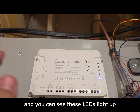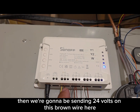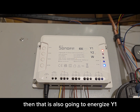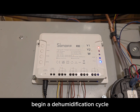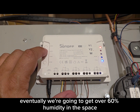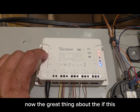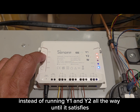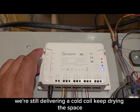Let's take you through a typical cycle and watch these LEDs light up. Say our thermostat is set to 50% relative humidity and it is above 50% in the space — we're going to be sending 24 volts on this brown wire, ready to be used. The IFTTT automation is also going to energize Y1, and regardless of whether we're calling for cooling at the thermostat, we start calling for the compressor to begin a dehumidification cycle. If humidity continues to rise and Y1 is simply not enough, we'll eventually get over 60% humidity and kick on Y2. As humidity starts to come down, instead of running Y1 and Y2 all the way until it satisfies, we can cycle Y2 off while still running the compressor to keep delivering a cold coil.